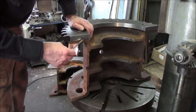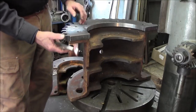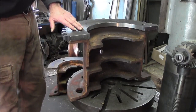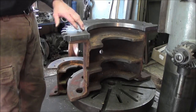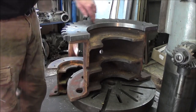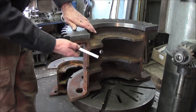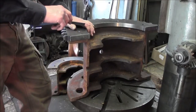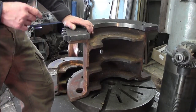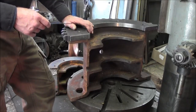So we're going to go ahead with our plan, because we need to modify these laggings so that they'll take this bolt pattern. And then we're going to have to set up the 2 sprockets, our 6 pieces. We're going to have to cut out the center again to accommodate that diameter to slip in here. We're probably going to cut all 6 of these in the plasma cam, just to get it done.